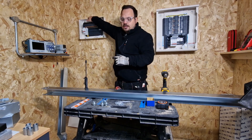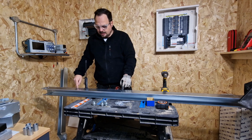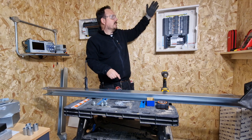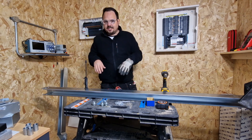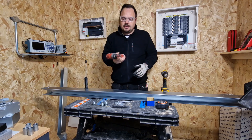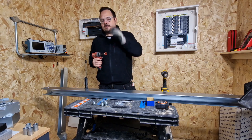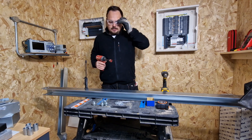I need to get them set up with the containment at the very least. I've positioned the trunking up on top and just marked through for the two holes in the position it needs to be. That end is really easy. On this other one where the gland plate is, I've marked the outer edges and come in a similar distance from each edge, being careful to position the holes on the trunking where it matches up with a sensible position on top of the distribution board — because this one is significantly deeper. Just make sure you don't score a line straight across and start drilling, because the holes may overhang the board. I'm going to use the annular cutters with a bit of cooling compound spray and drop these holes in now.